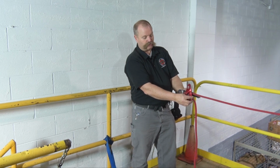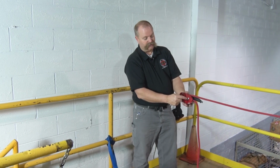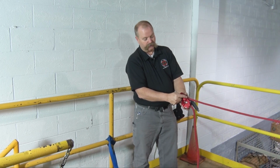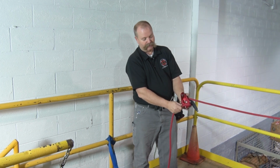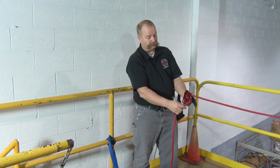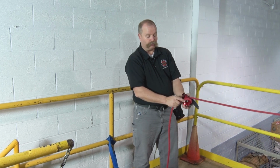Again, we're referring to the drawings. When I close the cover and I look at the drawing or the engraving on the front cover, I'll see the end of the rope down here coming out, attached to my load, and I'll see a graphic of my hand up here holding the rope like this. So I should be able to double check my work, cover open or cover closed. I have a point of reference.